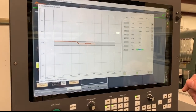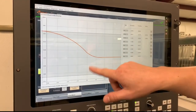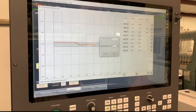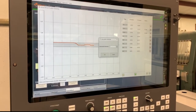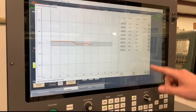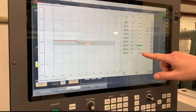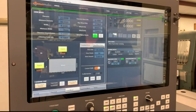So we've got our profile there. I can save this. We can also zoom in on any part of it to see if the profile is correct. Double clicking zooms you back out. I'm going to save this program — it's got to be a number between 2,000 and 3,000 for the grind wheel, and between 3,000 and 4,000 for the regulating wheel. So we'll do 2,100, hit OK, and I can close this out. We've got the profile in here — 2,100. I can re-edit it, click into any of those positions, and as soon as I type in, it'll update. I could delete one, add another one, exit out of there, and we're ready to go.